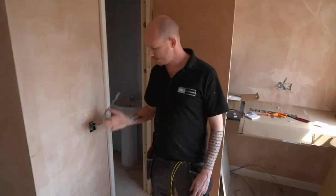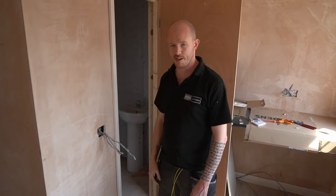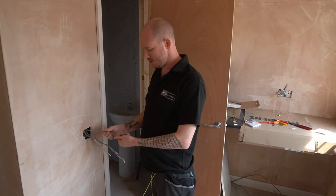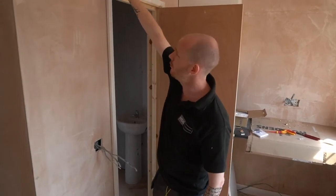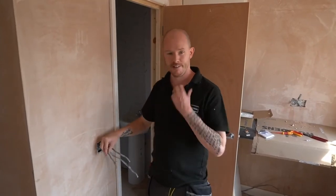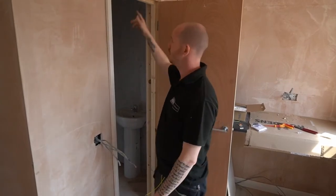Hello and welcome, it's Howard from HDS Electrical. Today we're wiring up a light switch. We've been left some nicely coiled cables by the plasterer, who also cut out boxes — not the greatest because they missed the whole bite of it. We've got a cable going to a fan, three-core going to our fan, a switch line, and a feed. Feed is your power, switch line does our two lights, and the fan isolator goes to the fan giving power and switch.